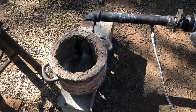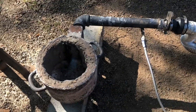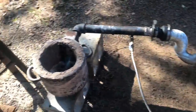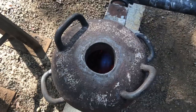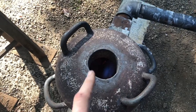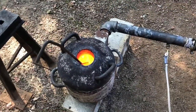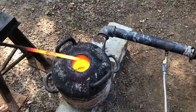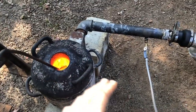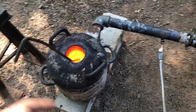The furnace is fired up — it's sputtering right now, which isn't uncommon as the chamber heats up. Once the fuel combusts correctly the burner will kind of fix itself, and then we'll crank the air and gas up and let it come to heat. After about 10 minutes the residual heat builds up and it's burning like it should, so we're going to let it run for about 20 minutes to get nice and warm before we put the crucible in. After 20 minutes we're pushing about 2,000°F, which is about where I want to put the crucible in.